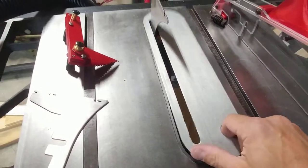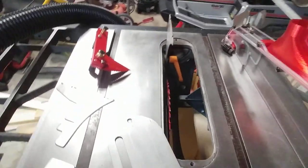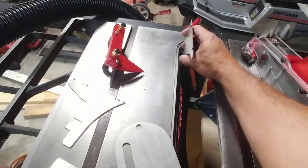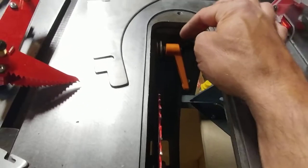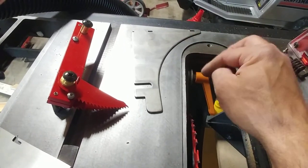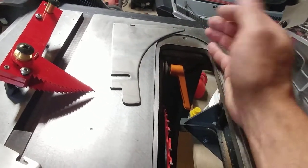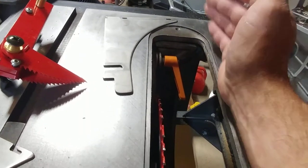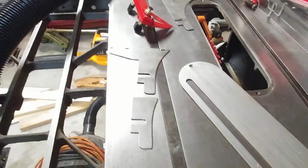Take the insert out. I'm probably going to get one of those polymer inserts and make a zero-clearance insert as well. There's this little ratcheting tool-less removal handle — slide it out and that's it. It's shaped so the bolt sits here and a step rests on the cast surface of the saw. You might have to take a file to make it perfectly fit your particular saw, but maybe Lee will come up with a more universal design for these 1950s–1960s tools.